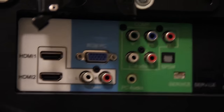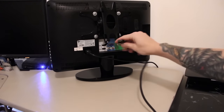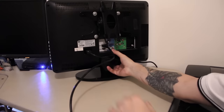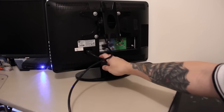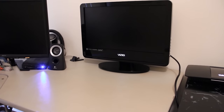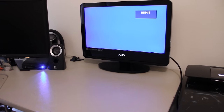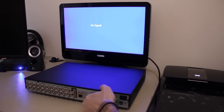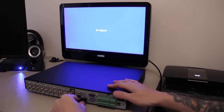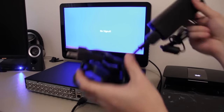You can also use a computer monitor with the VGA cable. I'm going to go ahead and plug the HDMI cable into the first input on the monitor. I've already got power connected to the monitor, so I'll turn it on and select HDMI 1. Then I'll set the DVR down and connect the HDMI cable to the output on the back of the DVR. I'm going to plug in the power supply for the DVR as well.